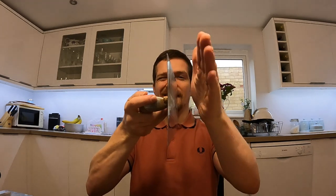The next trowel I recommend you buy is a flexi trowel. The base trowels never come broken in. So even though this says it'll be pre-worn, all that means is it'll be shaped — if you look down it, it's curved, not flat. You'd never want a dead flat trowel, and we'll talk about that in the future. When they say pre-worn, it's basically got a slight curve to it. The actual blade itself will not be ready for finishing the plaster.